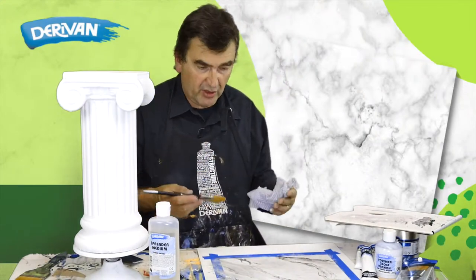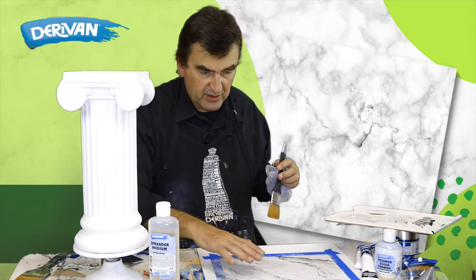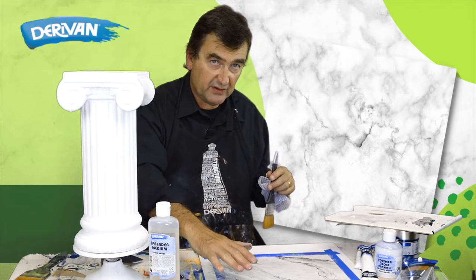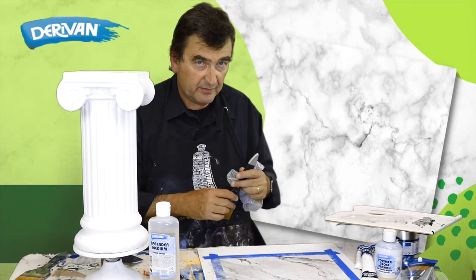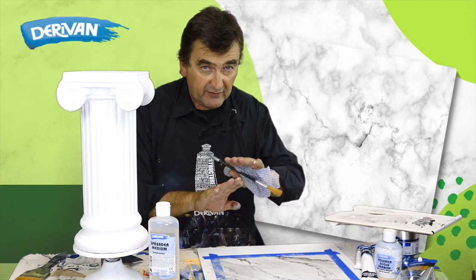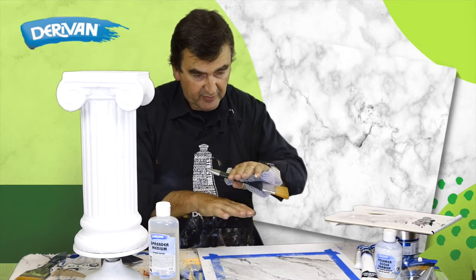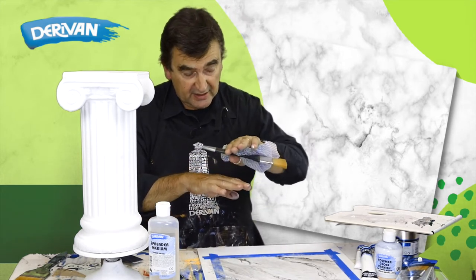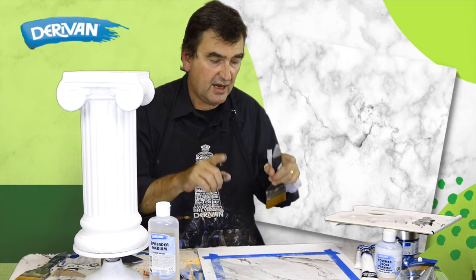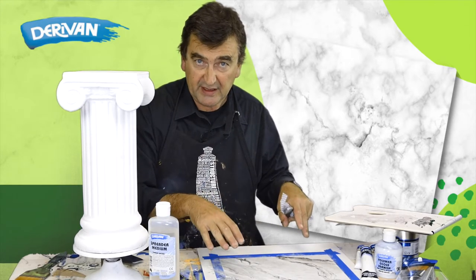As you become more experienced in doing the marbling, what you might want to do is paint — maybe do half of what we've done here, leave it to dry, put a coat of water-based varnish over the top, and then continue on. The reason you do this is because even though we're only talking fractions of a millimetre difference, putting the varnish on then another layer of paint — then maybe even another coat of varnish and another layer — it's enough to trick your eyes, when you're quite close to it, into thinking there's some real depth in that finished piece of marble.